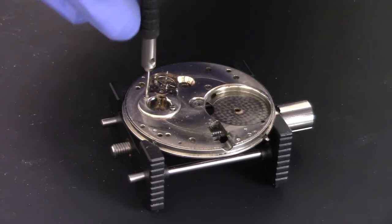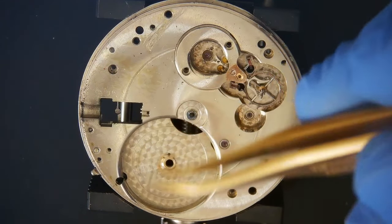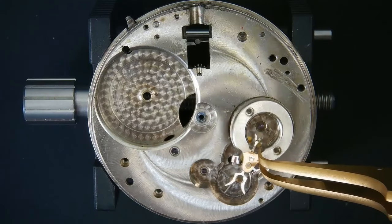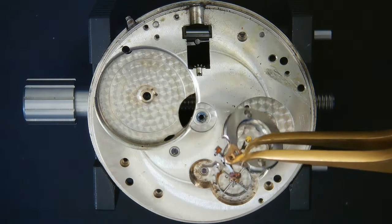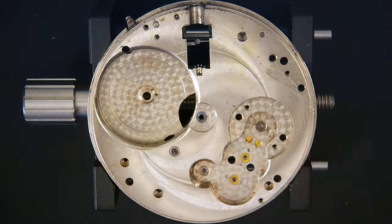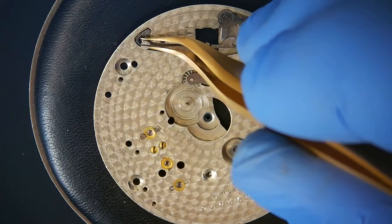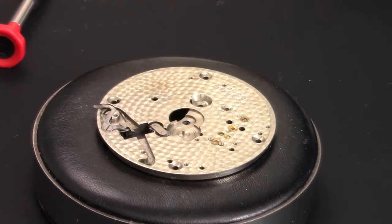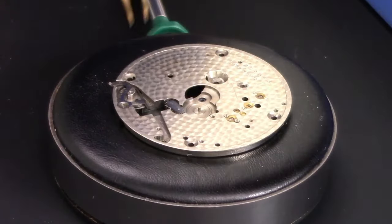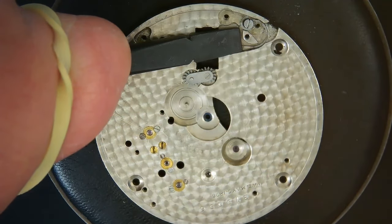Railroad-grade watches also had to meet other requirements, such as being lever set. So when we were testing the time setting, we had to remove the bezel and then pull out the setting lever tab, right? Well, this design made it so that a user had to be really intentional about setting the time and couldn't, you know, accidentally set the time if, say, the winding crown was pulled up, such as in a traditional watch. The watch dial also had to have bold Arabic numerals, which improved a watch's readability, and movement had to have a minimum of 19 jewels.